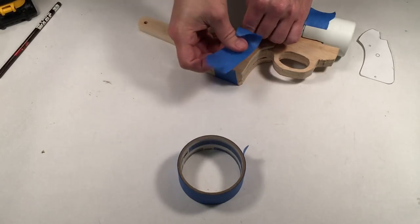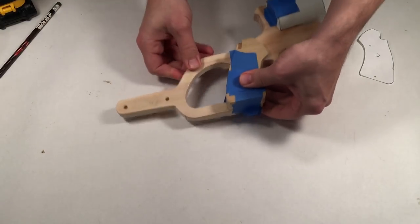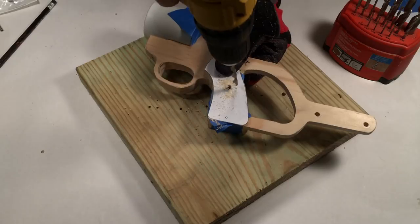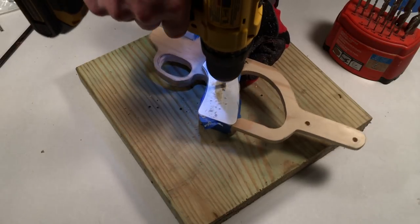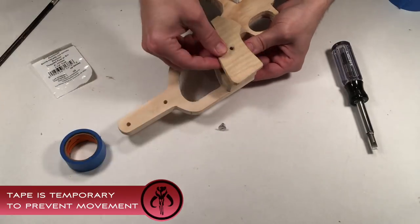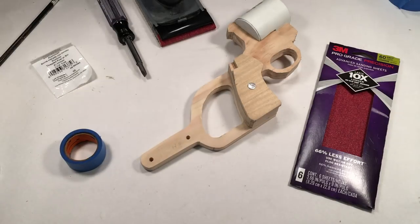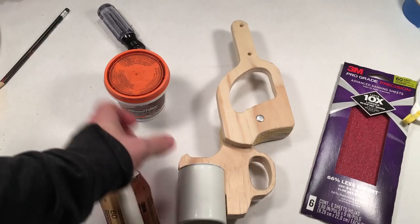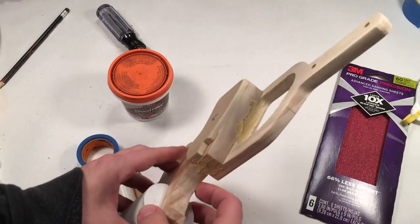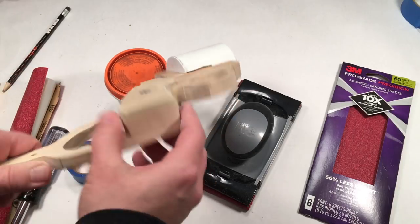While you have your drill handy, tape the 1/4-inch wood grip to the body and do the same with the half-inch stalk. Apply the template and drill a pilot hole through all three pieces of wood. Finish with a 7/32-inch bit. Secure with a 1¼-inch post screw. Use wood filler to fill in any gaps and then sand the handle edges down so that they are all even with one another. After sanding, remove the post screw.